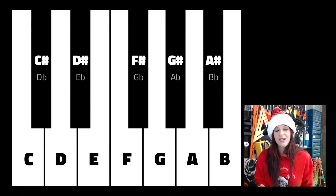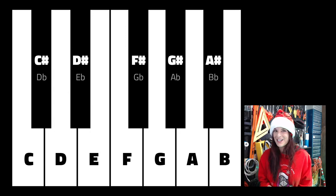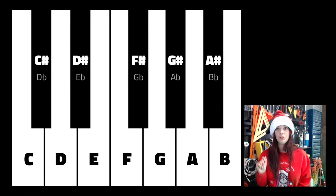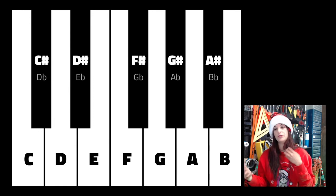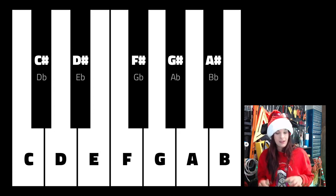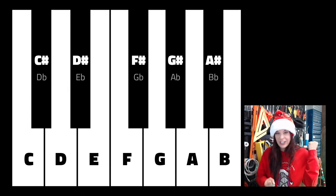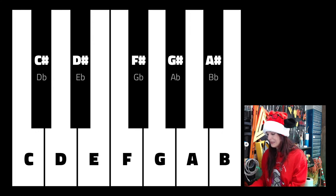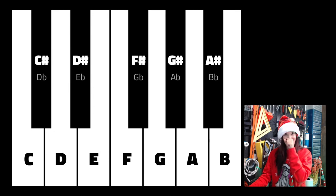It is milliamps. So 20 to 40 milliamps on an Arduino, with 20 milliamps ideal for those pins. And for the ESP8266, it is 12 milliamps. So we're going to use resistors and transistors to help keep everything at that level. Good catch, Larry, or else people would have been hooking up all kinds of stuff to their Arduino and then writing me, why did my Arduino fry? You fried my Arduino. All right.